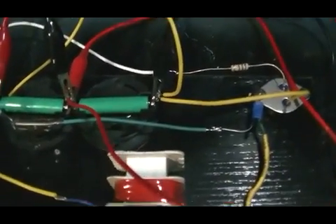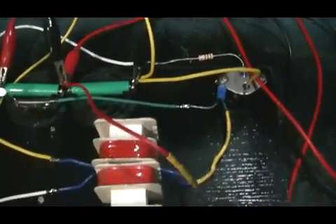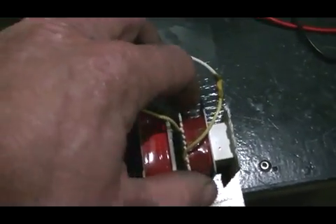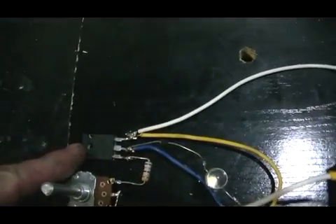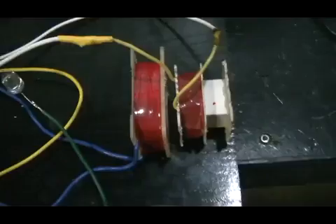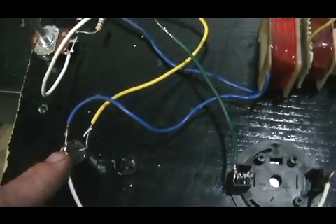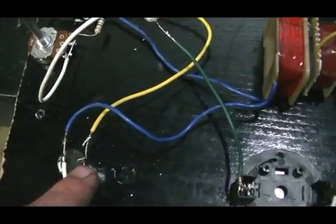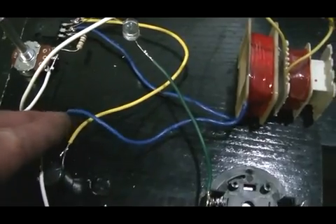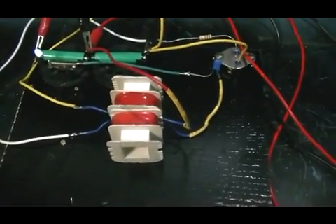We used very little power from the battery to charge it. The bigger circuit I've made uses the bigger coil, just using one of the small ones as a trigger, and I used a TIP2955 PNP transistor and ran it off a cap. It's a 25 farad cap — had two volts in it and it ran for about four hours, so not too bad, but nothing like that circuit. It's hungry — this one's using probably about 1.5 milliamps as opposed to that one's 500 microamps.